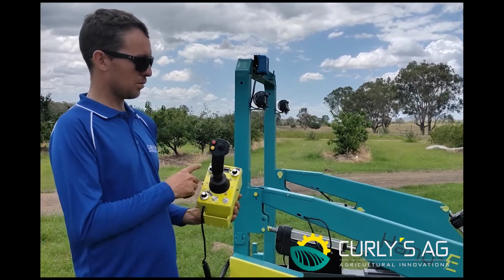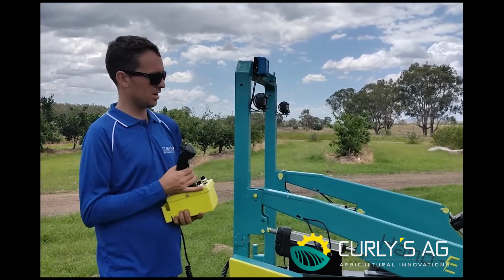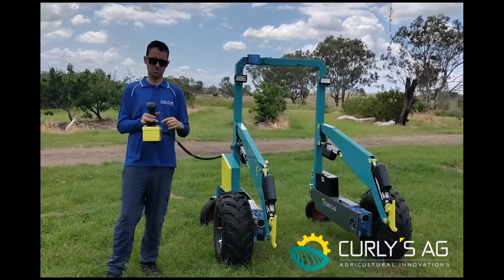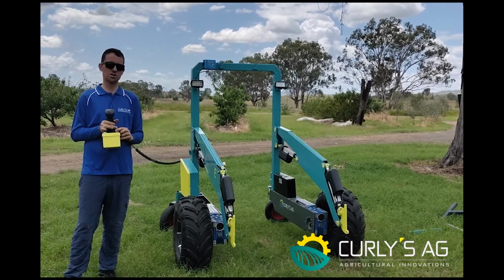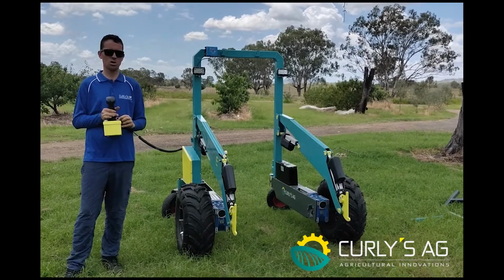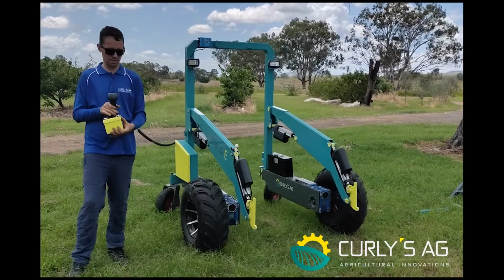Then up here we have leveling arms for your arm leveling, and I'll show you here. You can simply press the dead man switch, and if you go left or right, you can then trim your arms. Either if you're on a hill you want to level up your load, or if you want to pick up an implement on the side, or if you want to cut into a bank or whatever that may be, that's what that's for.